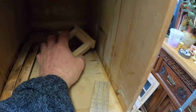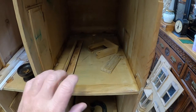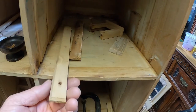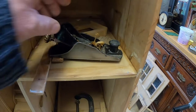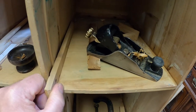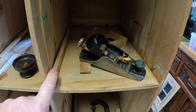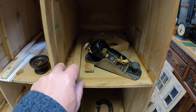I've put some panelling in. I've taken the fireplace off and I'm going to make a hearth for it. I'm going to attempt to put the skirting boards in and see what it looks like. The original skirting boards are very thick, so I want to plane them with my little plane to make them a little thinner so they're not so fat against the wall, because they're going to have panelling as well, and by the time you get furniture against the wall it won't sit properly. But I do want to keep the skirting boards because they are original to the house.